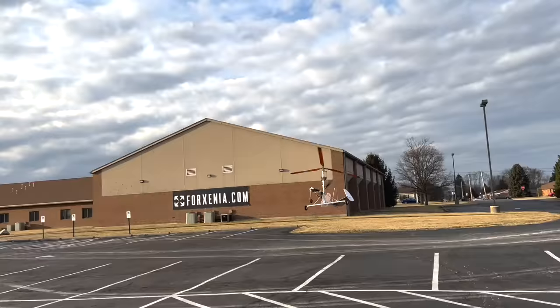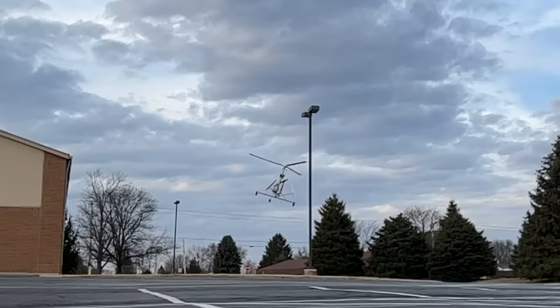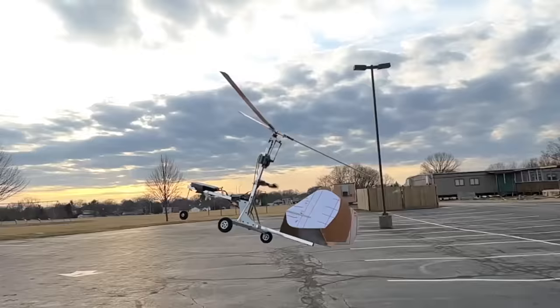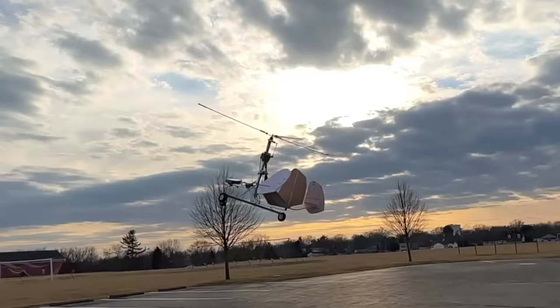The aerodynamic issue also goes to the blade design. Gyrocopters power the rotors through the oncoming stream of air. If you watch these in flight, the rotor is tilted backwards, unlike a helicopter flying forwards. The oncoming air flows upwards through the rotor system, and if you have the proper airfoils, they'll drive themselves once enough energy is introduced into the system to be in autorotation.